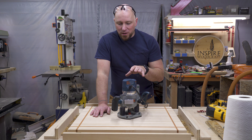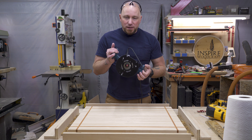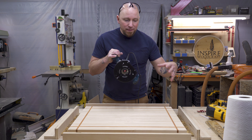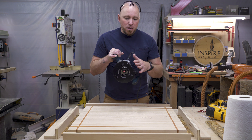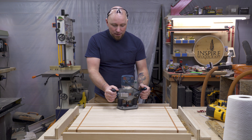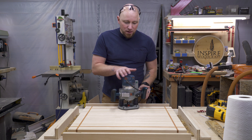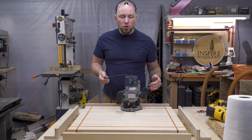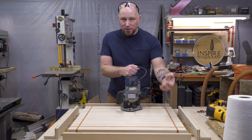It's a good idea to do a dry run. I want to think about my body positioning and specifically the router base. If you have a router base that is round with flats on it, you need to be mindful of where that base is as you get into corners. I use the round side — with the round side, no matter how I turn the router, if I'm registering up against something, my router bit stays in the exact same spot. If I use the flat side, it would actually pull the router bit offline if I twisted at all. However, going into corners, if that flat side gets into a corner it's going to kick out and not cut the line we intended.